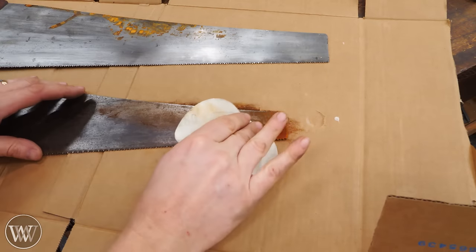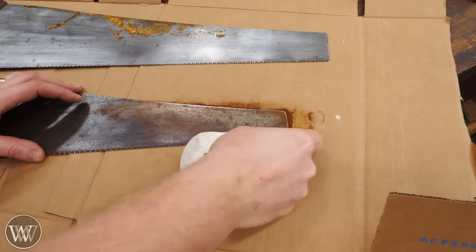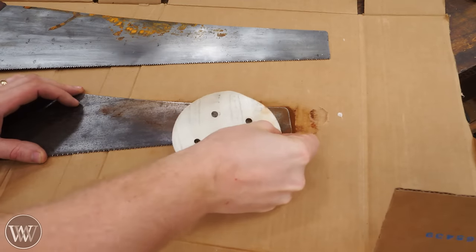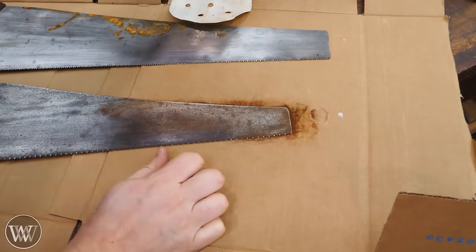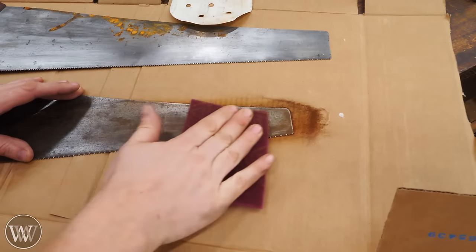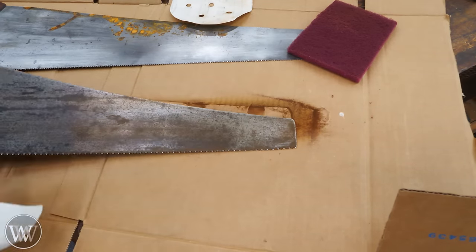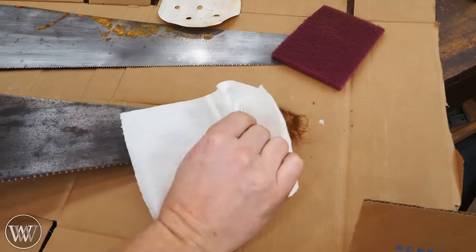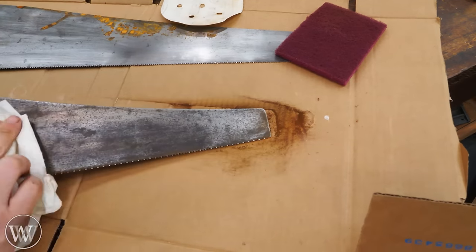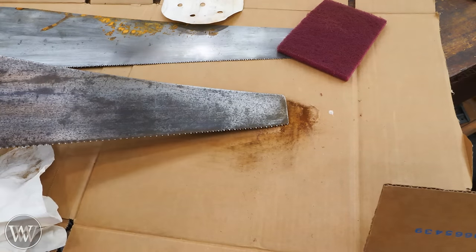This one's a little bit coarser, so I'm going to start with the sandpaper and go until the red disappears. I can still see some outlines, some of the darker stuff in there — I don't care about that. I just want to get rid of the red rust. And like that, we've gotten rid of that. I'm going to bring in the scouring pads — it's a little bit finer and it allows me to make sure everything's good. That's looking pretty good. I haven't had to use WD-40, so I'm just going to bring in a dry rag and wipe off any of the excess dust. And like that, we're pretty good.